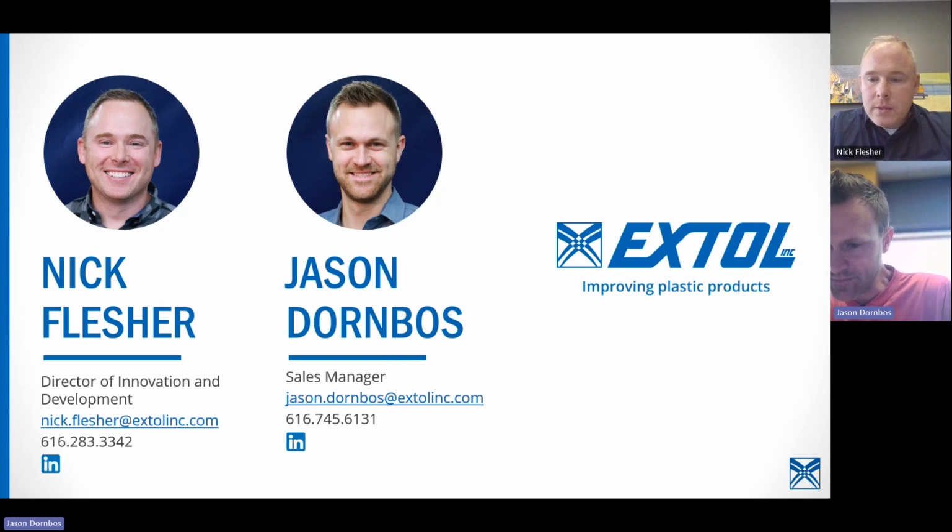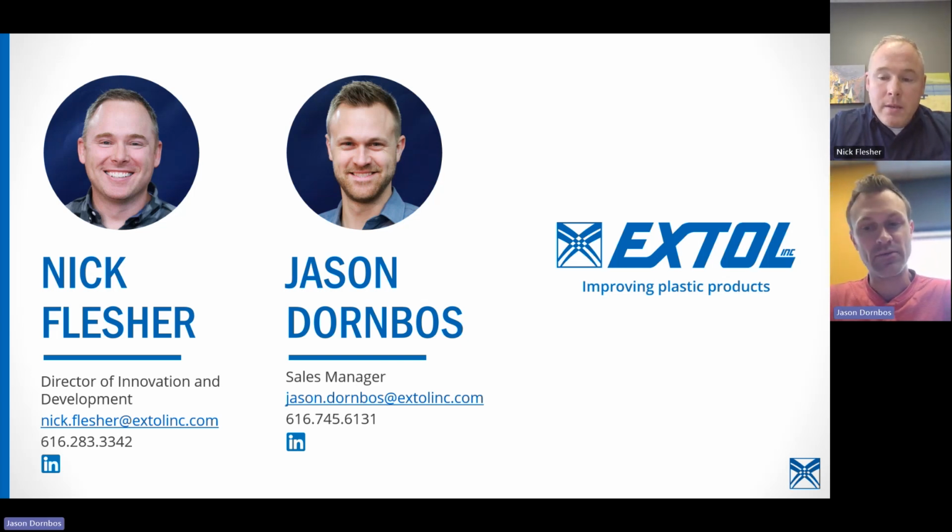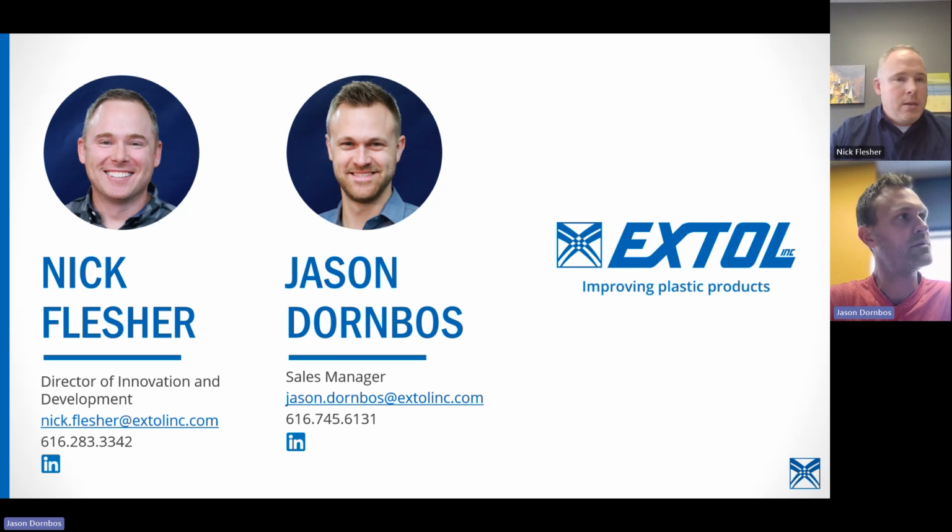Here's a question right here. What is your process for material compatibility testing? That's a great question. Sometimes we can use our own sample plaques. We've got a pretty extensive set of sample plaques. Sometimes, if you're working with a material compounder and you say you're going to be using these for laser plastic welding, that actually puts them in a category they know. We work with a number of companies that will give you samples, and then we prove compatibility.